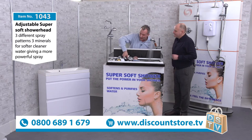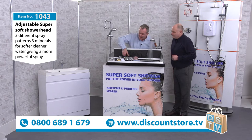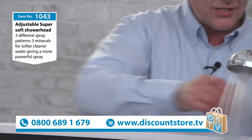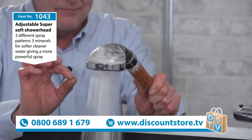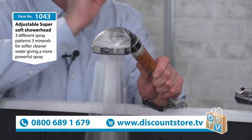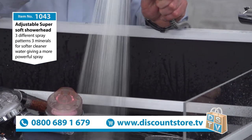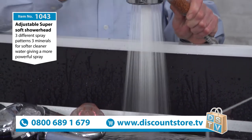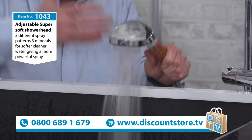The head of the shower gives you power but also saves water. A standard shower head uses 80 litres for an eight-minute shower; the larger-holed ones use 110 litres. Ours only uses 54 litres — half the amount of water. That's half the energy heating the water, so you save on your gas and electric. It may only be 10 or 15 pounds a month, but over a year that's a hundred and fifty to two hundred pounds — a lot of money.